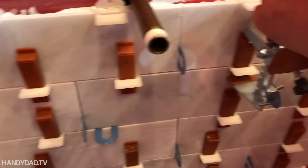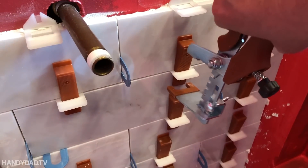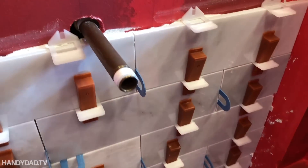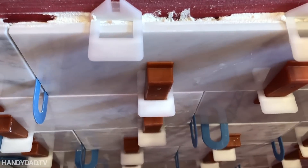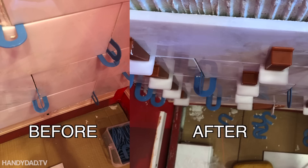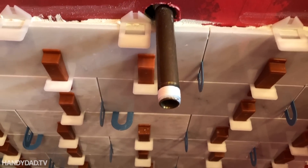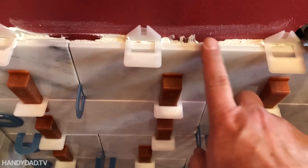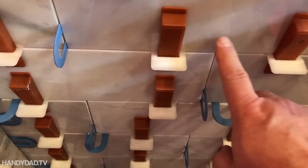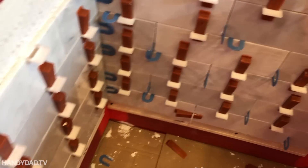You put the tool on like this and squeeze the wedges together. I'm not going to squeeze it because that one's already tight, but that's all you have to do. And then when you look down at the tile — I have a before and after picture that shows these things are much better with the leveling system. The reason I really need to do that with marble is because it doesn't have much of an edge — just a very slight bevel. So the tiles need to be exactly flat and nicely even.